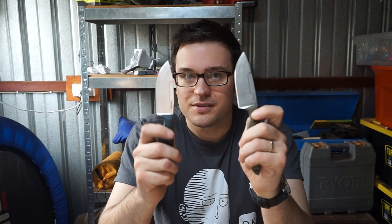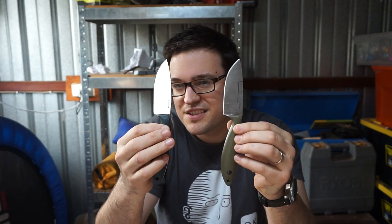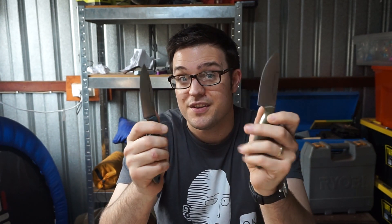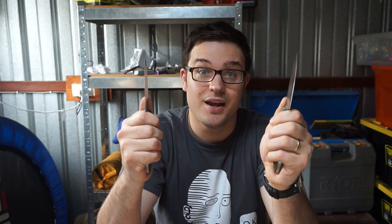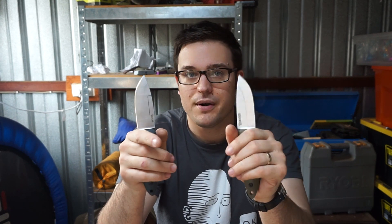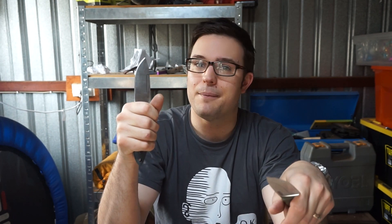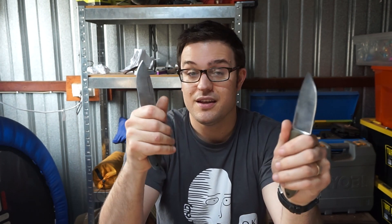So Shannon Steel Labs has made two knives that are more or less the same. This one has a slight ramp to it, but in terms of edge geometry and Rockwell hardness, they're the same — 60 Rockwell on both knives. One is Z-Finite, which is LC200N, a different name for it. And one is Vanax Super Clean, which is a fairly new steel. They used to make Vanax 35 and 75; this is the one they're making now, and it is a more advanced steel in terms of their recipe.